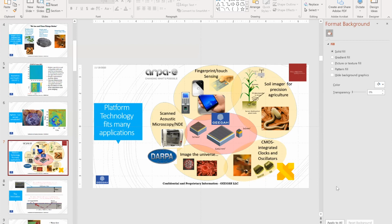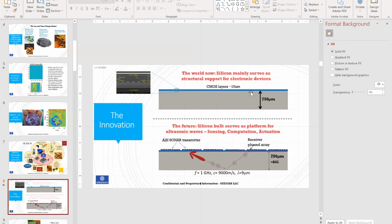Yeah, so that is a good question. Because we're operating our pixels at 1 to 3 gigahertz, or even higher, the immediate sense you might think is that, oh my God, each pixel is going to consume milliwatts. So if I have 16,000 of them, that'll burn the chip down. Except the thing is that the transit time of our pulses is very short. It's about 190 nanoseconds, and you're only turning on the little pulses for 50 nanoseconds.